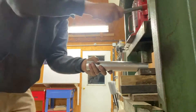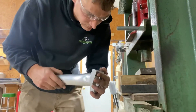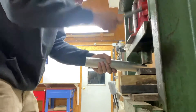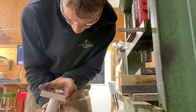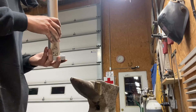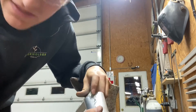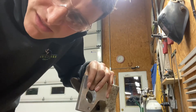It's squishing down pretty nice. I'm going to take it out and see how it matches the shape that we need. What was round is now an oval. It may not be tall enough. One thing I'm noticing is this bolt right here is going to be really tight getting in there with this pipe. I think I'm going to ding the pipe in a little bit right here to make clearance for getting at least an allen — a socket cap screw — in there.